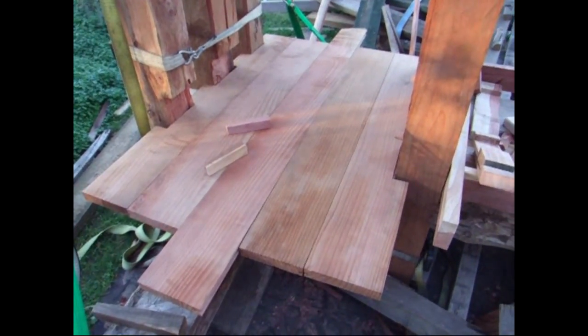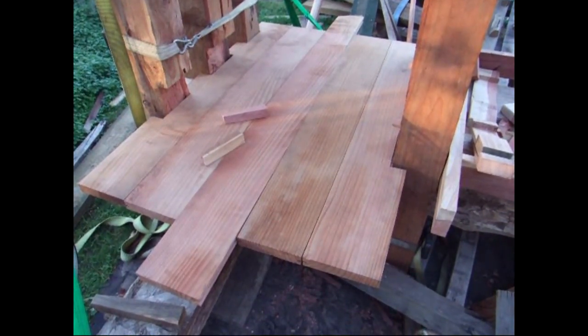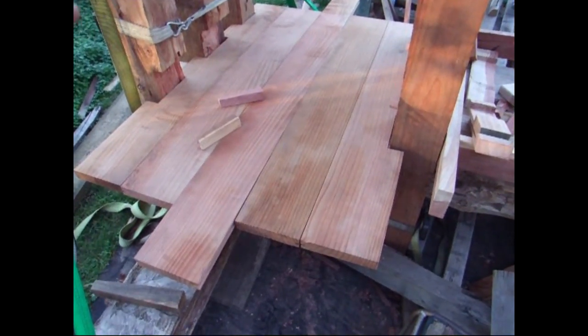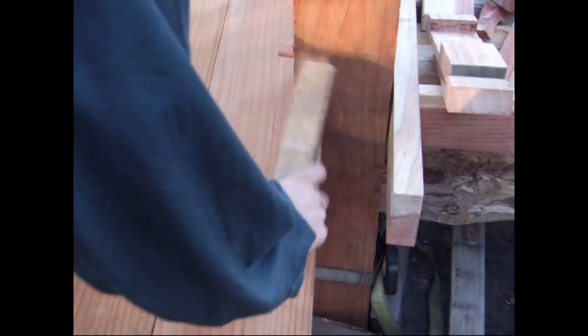The first thing is we've got this sliding taper which seals the floor. We knock that board in — it's tapered — and that closes up all the gaps in the floor. Then to secure the floor, it tightens up very tightly between the posts, but just to secure it a little bit more you can see that gap there. Into that gap goes a wedge, and that just knocks it home.